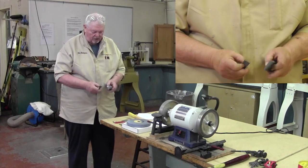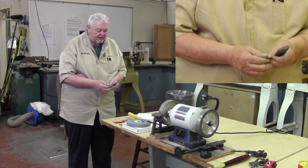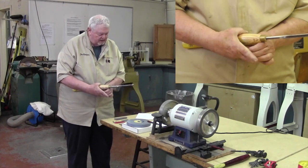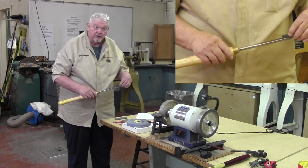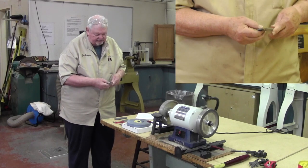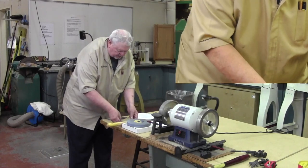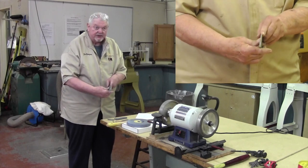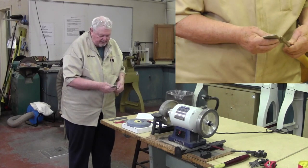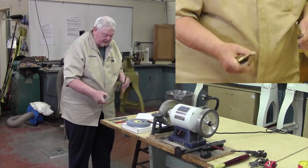This I liked a lot — this is a set of honing stones from Henry Taylor. There's a large one and a small one. Both edges are radiused on both of these, which allows you to get inside the flute. The smaller one fits and gives me a chance to hone the inside. Allen Lacer has come up with one that's a DMT stone, 600 grit, but it also has the radiused edges — Henry Taylor's with real stone, Allen Lacer's with a diamond stone. If you ever want to hone the flute, those work.